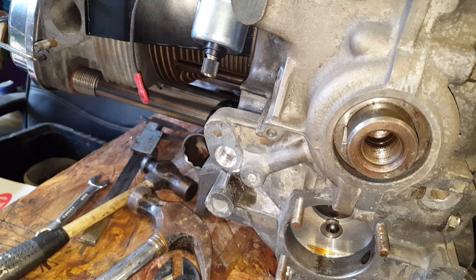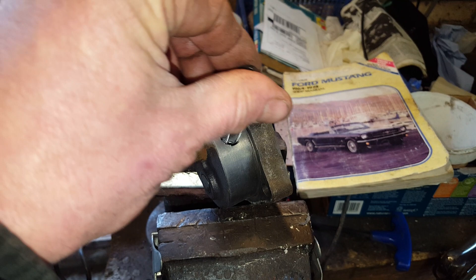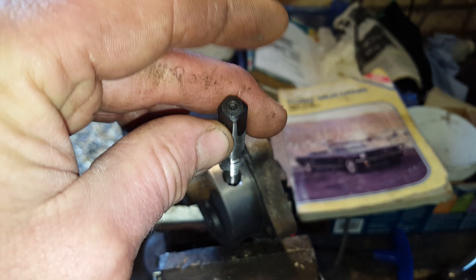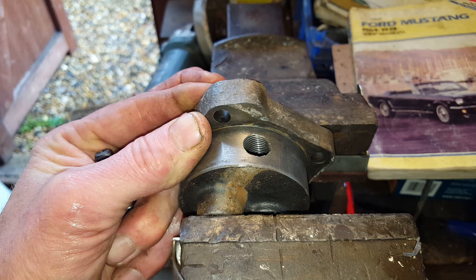After that, you need to address the return to the oil pump. This hole does not need drilling out — it is suitable straight away for the 1/4 inch NPT tap. This tap will go straight through that hole without pre-drilling. Again, keep it square and ensure you don't wander off. Get a friend to check the angles — it's a little bit awkward because the pump is not easy to keep square, but once you've got that hole square and tapped, it is ready for the small plug.